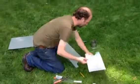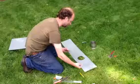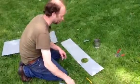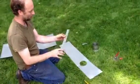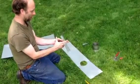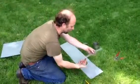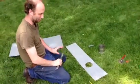The next thing we need to do is figure out a way to fasten this into the damper. The way I choose to do this is by placing a hole here and a hole here, and threading a bolt through the backside of these. Then using this piece of metal with the holes already in it, we're going to cut this in half and make two spacer bars that will span the damper opening. The thread will come through them, and as we screw them down it will cinch the back plate up against the back of the damper.